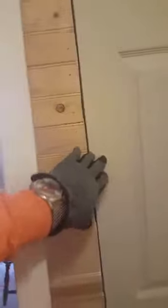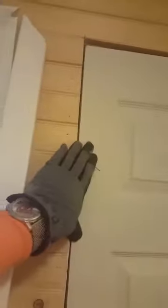After we put all the nails in - this door does not have a door jamb. We did not put a door jamb on this door, as you can see. We're going to put a door stopper but not a door jamb, because that would have shrunk the hole and you'd end up trimming the door too much. So what we're going to do is put the other piece of trim. We have two ideas: we can either drill a hole to put a doorknob in, or put a magnet door stopper where you push it like a cabinet-type door and it stays closed with a magnet. We'll see what the customer says.